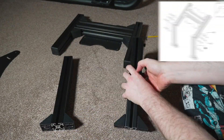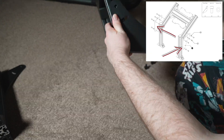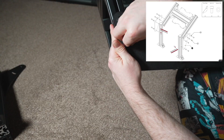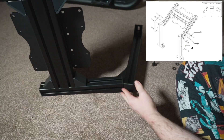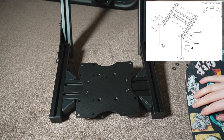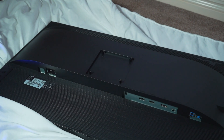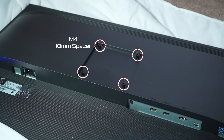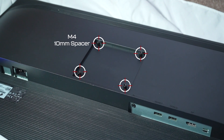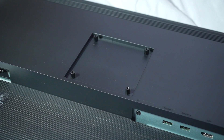This is the final step and involves securing two angled brackets which are going to act as the hinges to position our quad mount once it's in situ. Just add in the nuts, make sure you put a washer in as well, and simply tighten everything up. Note that if your monitor has a recess for the VESA mount, you may need some spacers — they include M4 10mm spacers which you'll need to add in to secure the VESA mounting plate correctly.